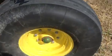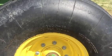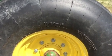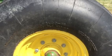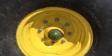A lot of these tractors came with either 10-16s or some may have even had a 15 on them. But for loader work, you're going to want to have the 11-16 on the front. They handle the weight a lot better and they ride better.